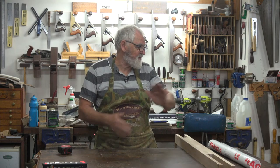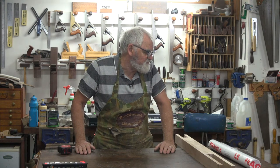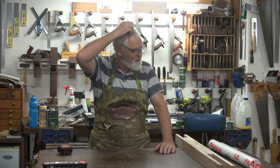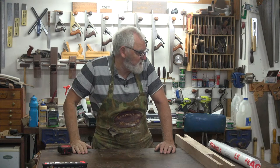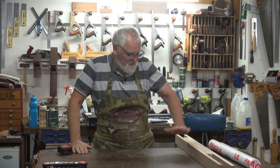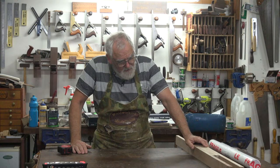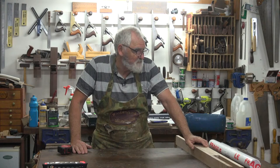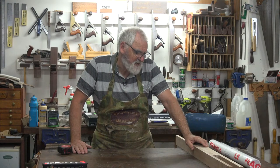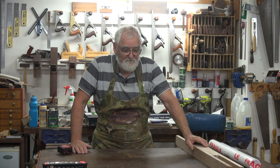But that's about it. The main thing was I wanted to get the chair, give that maybe another coat of oil, and then glue the arm tomorrow, wax it, so it'll come up really nice. This, as I said, I most likely biscuit it together, cut the internal out in a dado blade, and then I'll play around with some routers to give it a bit of shape.